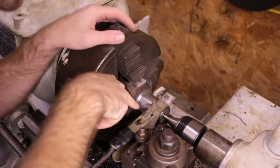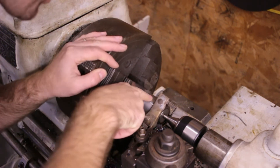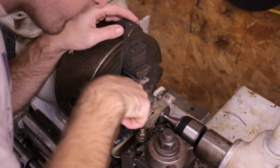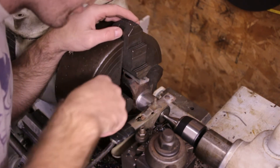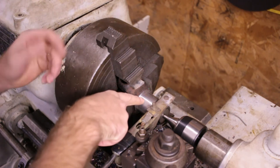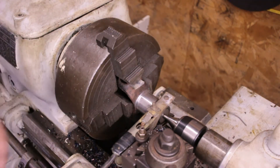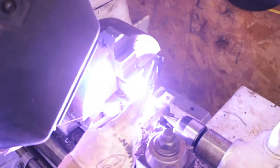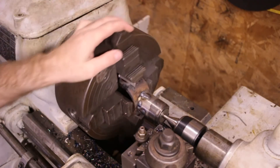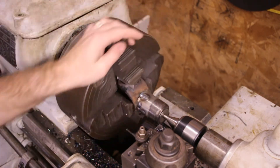It's a new day. I'm working on getting the universal joint welded and polished down, but there are a couple of little spots that need a touch-up weld. I'm going to run a TIG bead along there — that should probably be the best way of getting a good bead in that area. I could MIG it again, but starting with a MIG you can sometimes get a cold start and end up with a new pit. So I'm going to TIG weld that. I probably did a bit more than what I needed to, but I'll turn it down and see how it comes out this time.